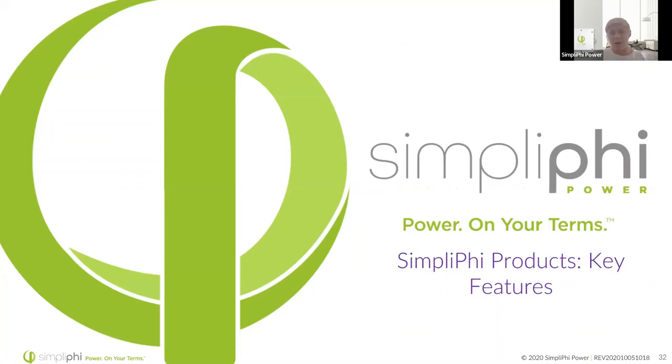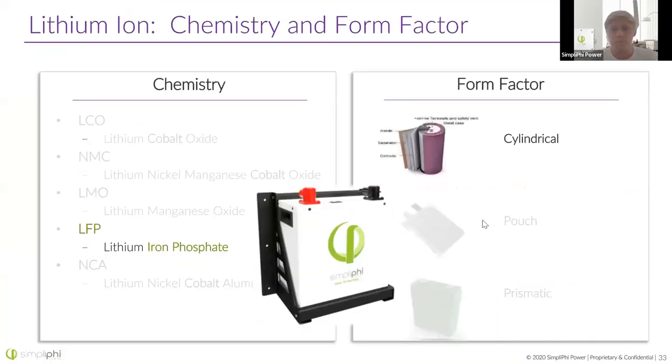Let's talk about some key features of our products and how they relate. We use only lithium iron phosphate chemistry and cylindrical form-factor cells — we don't use pouch cells or prismatic cells. Pouch cells can be fragile, prone to swelling and puncture, which we don't want for large-scale or residential systems. Prismatic cells can be a great option, but for our form factor they don't make as much sense for the layout — we can't fit as much power in the space, and they're a little more limited in their life cycle and protection capabilities.